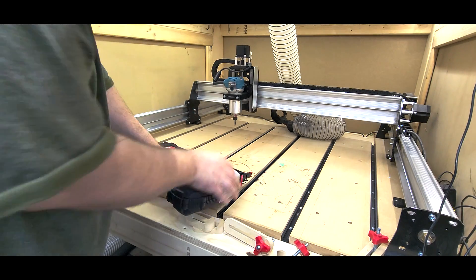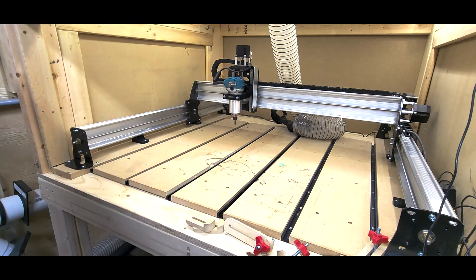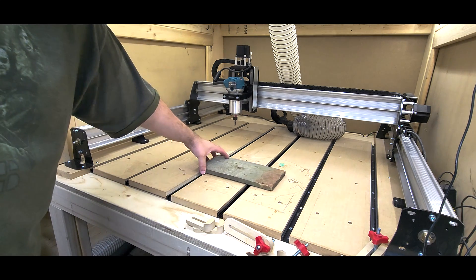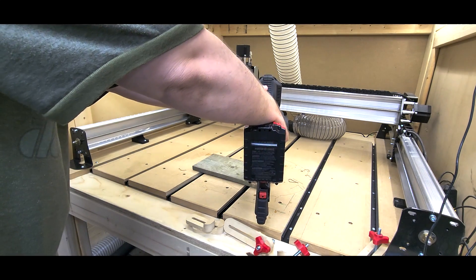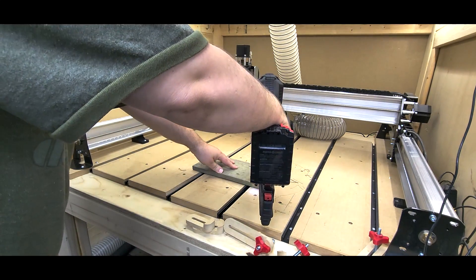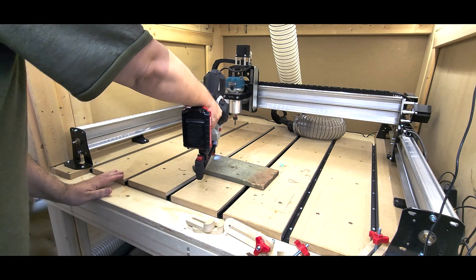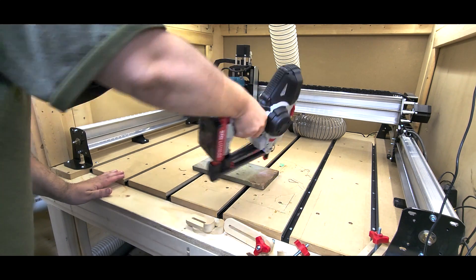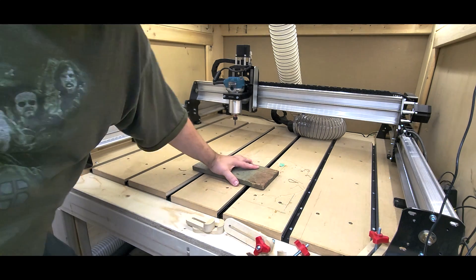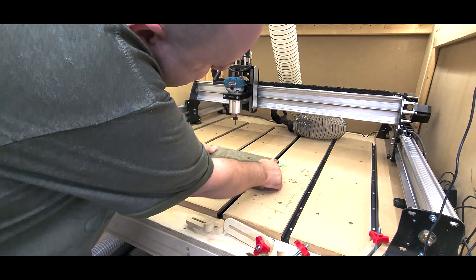On my CNC channel, I thought I'd show how I could use this with my CNC machine. This wouldn't be good for every situation, but if you need a quick clamp down, this is one way you can do it. You want to go right to the edge as far as you can so you're not going to hit the nails with your bit, and you might need to cut off the edges, so make the board a little bigger than what you actually need. Four nails did pretty good to hold it solid, but it still came off pretty easy. The nails mostly get left in the spoil board, then you just take a hammer or a pair of pliers and pull them out.